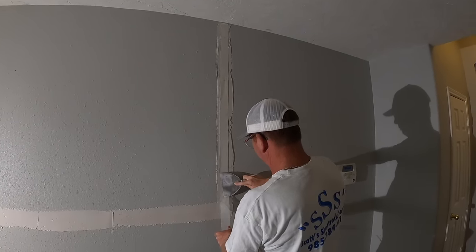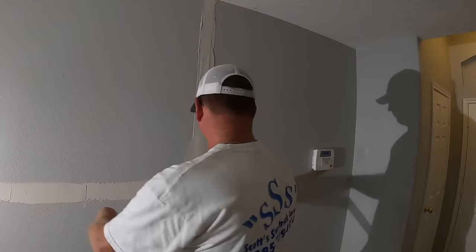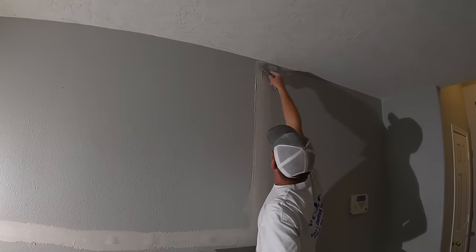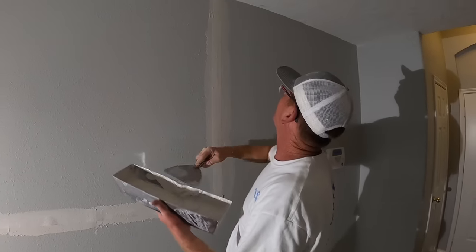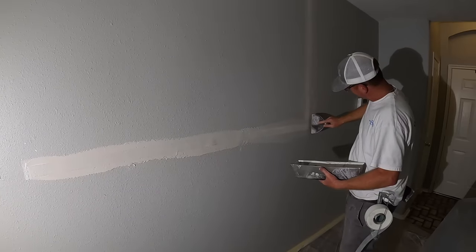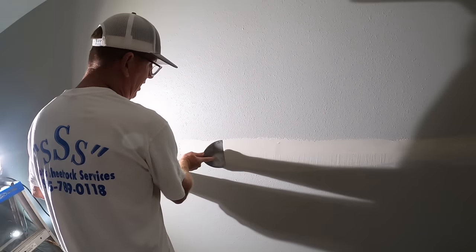This tape is very, very difficult to blister. I'll wipe that bottom end and then add a little mud over it. You always want to go a little bit past your crack to make sure it'll cover. I like to wipe one side at a time with this tape, because it might tend to break on you if you go center. If you do, just do one side at a time and then go center — it'll lay down real nice. I'm wiping that bottom first, then the crack, putting all my pressure on the bottom and not just center, laying it down flat.